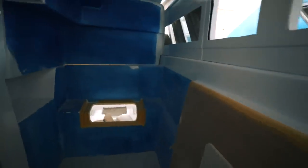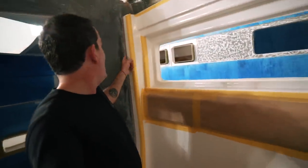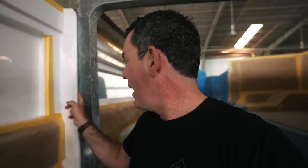This is the aft heads. Last time you saw this, a lot of work was incomplete — the window sections were just loosely placed as try-in templates. Now we've got bonding: it's all glassed in and solid. We talk a lot about squeaks in catamarans, how much noise they make. That squeaking you can hear is simply a piece of plywood placed temporarily over the bilge. The goal is to have things that don't rub against each other. There is zero gap here — a full bead of glass, all glassed in and rigid.